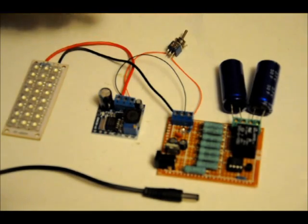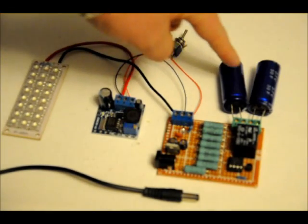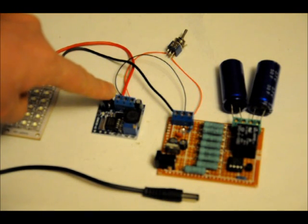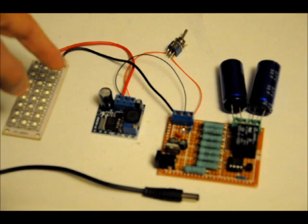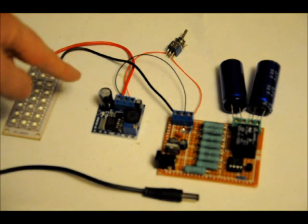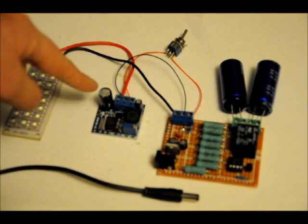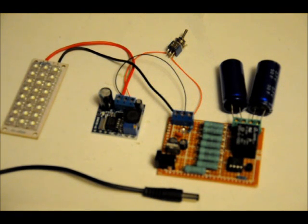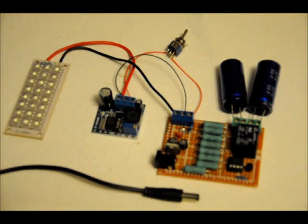At that point, we can flick our switch, which takes power from the storage in the capacitors and puts it through our 3.4 to 34-volt booster. All it needs is 3.4 volts DC at the input and you can boost anywhere up to 34 volts. We're actually using it to boost up to 8 volts, powering our LED bank. You can boost to 12 volts for maximum luminescence, but just to save power in this case I use 8 volts. It's still pretty bright and you save power on the capacitors.